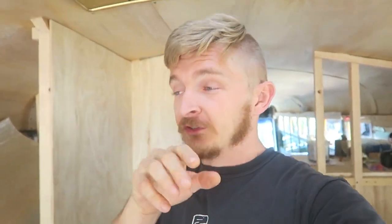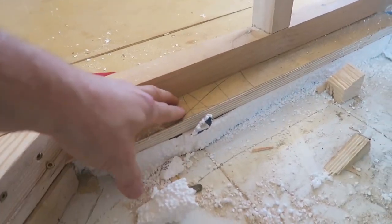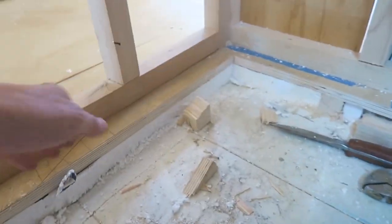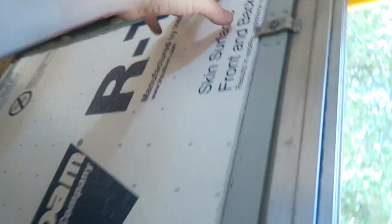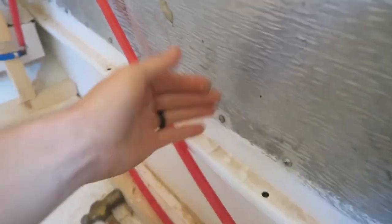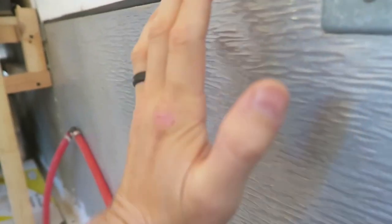Today I'm going to work specifically on prepping the bathroom for our first layer of mud, where our goal is to actually do a little bit of concrete work. We want 90-degree angles here because we want the wall to mortar on top of the floor. I want to get all of this wood and insulation cut out all the way around, then add inch-and-a-half pieces here to attach the hardie board to the outside, which will give us all the strength we need and also provide conduit spacing for the pipes.